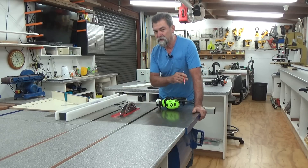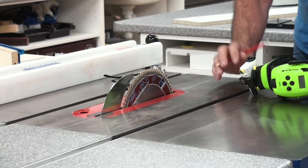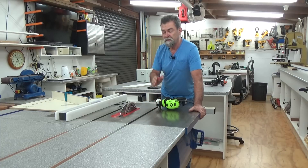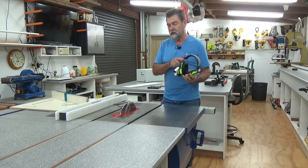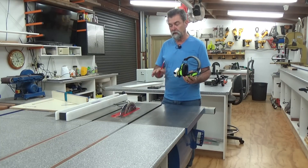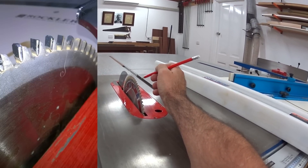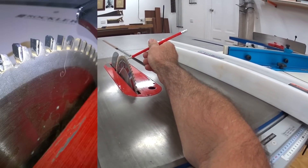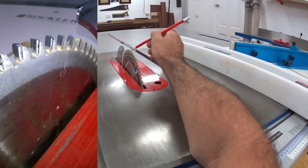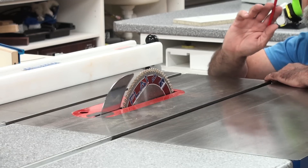I'll give you a little bit of disclosure — I was given this blade and another one by ProMac in Australia. The reason they gave me the blade was I made a very nice display for them out of some really nice Australian hardwood, which they use at the shows. This blade is designed specifically for cutting melamine. It has a chamfer and a flat section at the top, then back to a full flat tooth — chamfer, chamfer, flat. Some people refer to this as a triple chip. That's the blade. Now here's the trick.